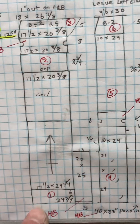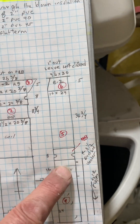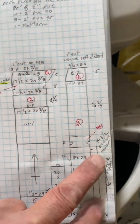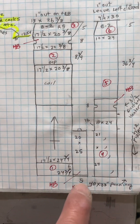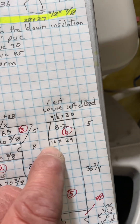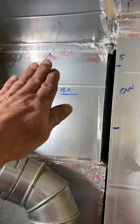I won't line that; I'll line the bottom here. He's just worried about the sound. If it doesn't work, I'll have that for the future as per homeowner. Jason, put in a five-inch wide filter box that comes up just as it shows. I'm going to go 10 to 9.5 because we only have 9.5 from here to the wall. I'll set back two inches on supply and return.